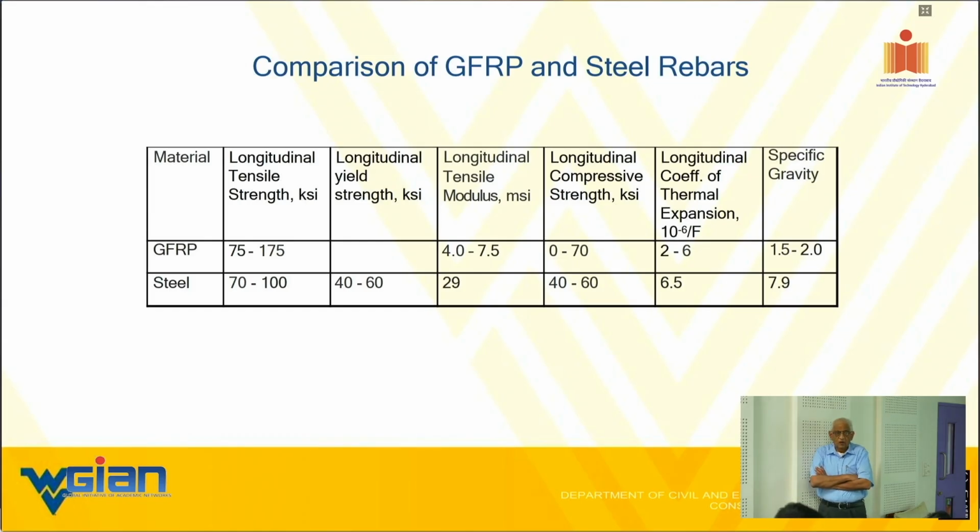That said, we have seen composite rebar failing at 22,000, and you multiply it with 6, then what do you get? 132 KSI, right? So, as a designer, even if I assume 20% less, 18,000, I'm still getting 104 KSI. So, that's good enough for you, because from a design point of view, we are not using the ultimate failure stress or strain. We are not. What are we using?